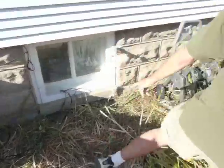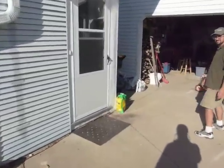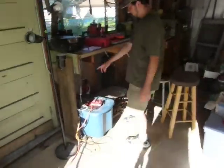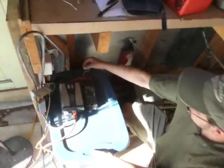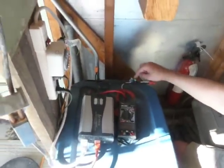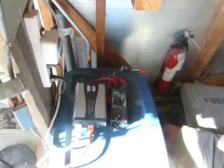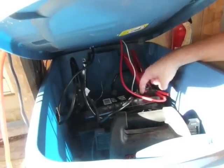The wires come down this line and run along the side of the house, right into a box. Inside the box, this is the line that came from the solar panels — approximately 2.5 amps. It comes into a 12-gauge wire, and I soldered a 30-amp fuse in series there just for protection — so if somebody disconnected or shorted something, it's safe. From there it goes into a 75 amp-hour deep-cycle marine battery.